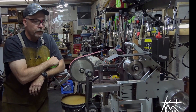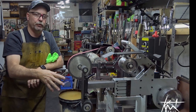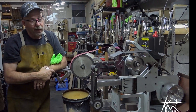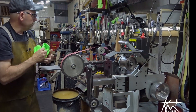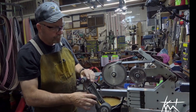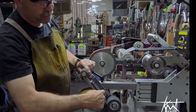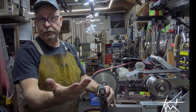What we're going to do is go over this platen - talk about it, its features, why I designed it the way I did, and then we're going to do additional videos on setting it up and how to use it properly. Right now the platen is available with the metal platen face. Probably the biggest improvement during prototyping is that this platen is 180 degrees reversible on the vertical plane. You can pull these two socket head bolts out and flip the platen 180, so if you wear one side down you've got the other side to use.